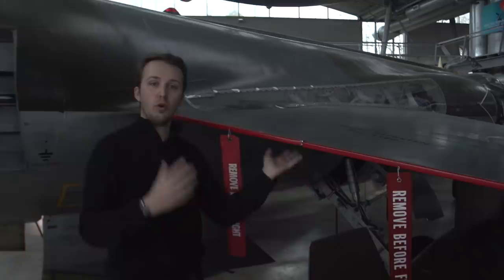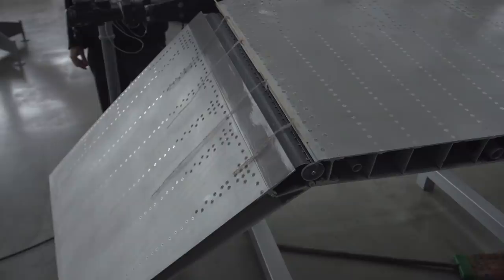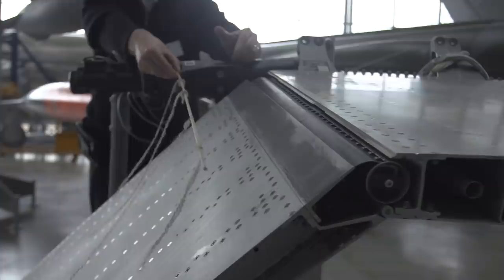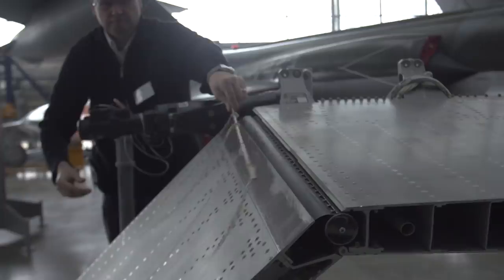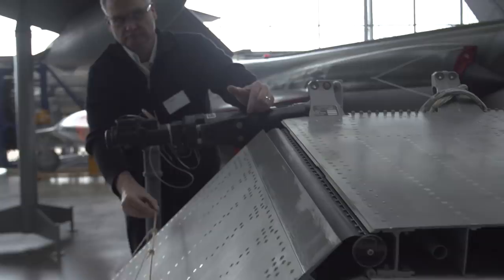Then we come to the flaps — again, very special. These are blown flaps and they are fed air by having an air bleed from the compressor. Here we can see a demonstration of the blown flap or boundary layer control system. Air is bled from the compressor and injected by a duct running along the flap into the upper airflow from the slot between the wing and the flap. You can see the airflow here via the clever use of a high-tech tool known as a stick with strings. This injection of air from the compressor delays the boundary layer separation from the wing, meaning you increase your maximum angle of attack before the stall. It automatically activates after a deflection of 15 degrees and, together with the leading edge flaps, allows the Starfighter with its very short wing to land at a lower speed than it would usually have to.